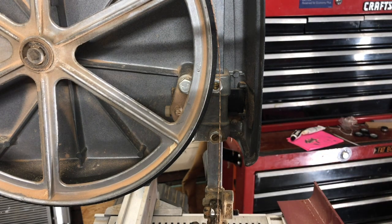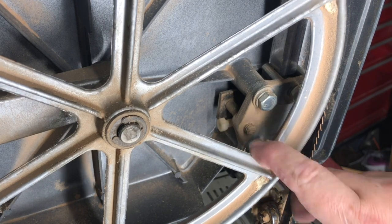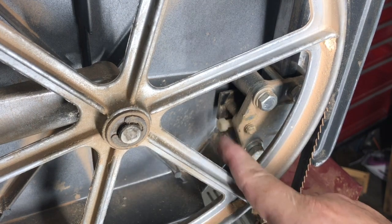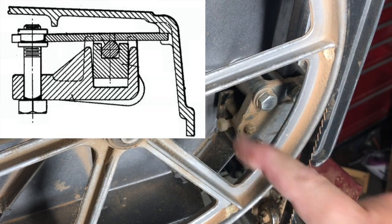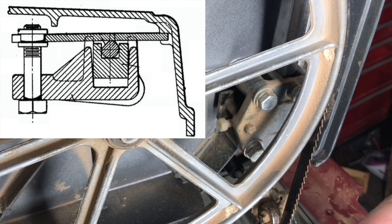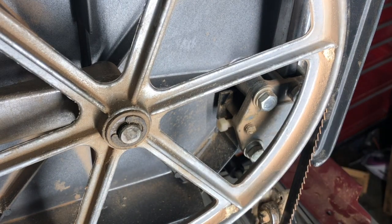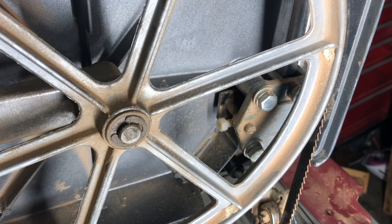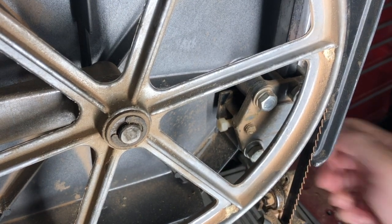If you look right here, you can see a black leaf spring. Looking in from the side with some light: there's a bolt — actually the tip of a bolt, with the head of the bolt behind that steel leaf spring. If I take this bolt and rotate it counterclockwise, I'm driving it forward, pulling the leaf spring forward and applying more pressure against the back of that bar. So if you move the two brass screws forward and the handle becomes loose, you'll want to turn this screw forward as well. Not every Shopsmith bandsaw has this nylon bolt — it was added probably in the 90s or early 2000s so that when the post is loose, it doesn't just fall. It's adjustable.